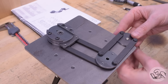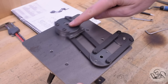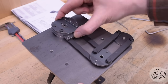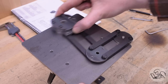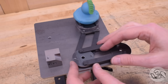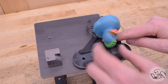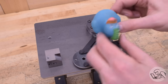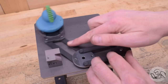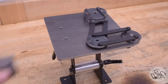I can now mount it on the four-bar linkage for now. Everything gets bolted in from the underside using the same Delrin bushings and so on that the four-bar linkage used. Clamp that back down on the table, and here is the four-bar magic — no matter where we slide this workhead, it maintains its orientation. It's a really, really cool mechanism — it's one of my favorite things you can do with four-bar linkages. Swarfy the metric duck will demonstrate this more clearly. As you can see, no matter where we move the linkage, Swarfy's beak always points north. That is really, really cool.